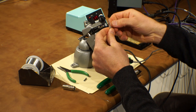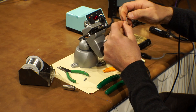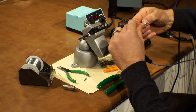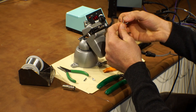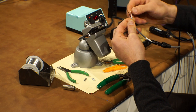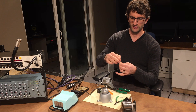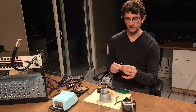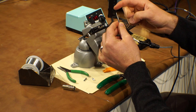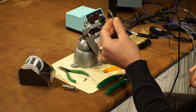Then I want to get these all separated out. There's a bit of foil around the two conductors — let's just get rid of that. Now in this cabling there's always going to be three wires, and that's what actually makes these a balanced cable, like I mentioned earlier — what will reduce interference or hum over long distances. That means they're going to have a ground, a positive, and a negative. Those would go on to pins one, two, and three.